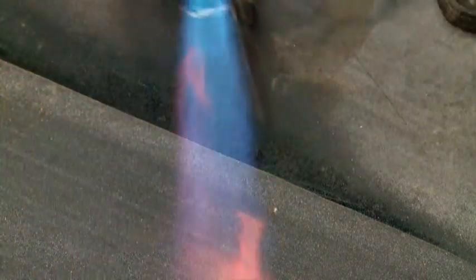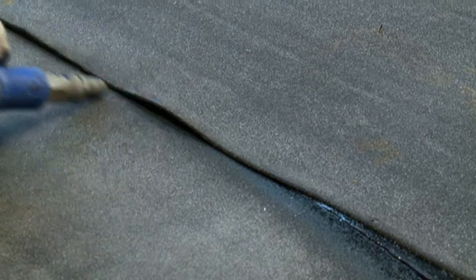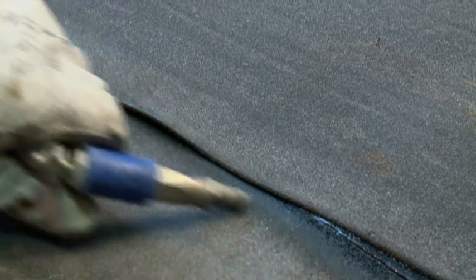Pass a guide pin, or the end of the trowel, along the weld. In places where there is no excess melted bitumen protruding from the sides along the overlap, press the membranes together with a heated trowel or iron and manipulate the melted bitumen into a chamfer. If the overlaps are not fully and correctly bonded, compressed air will lift the uppermost membrane and slightly inflate it, giving a good indication of areas that are not welded correctly.